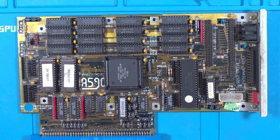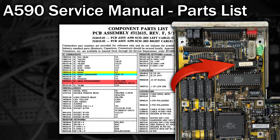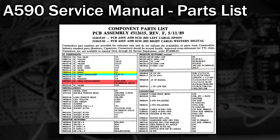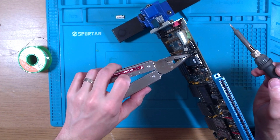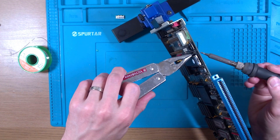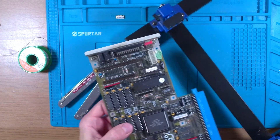Now before powering on there's one further step. If we take a look at the A590 service manual we can see the original DMACC listed here. But interestingly if you take a look at the next line you can see the version 2 of the DMACC is also listed as a substitute. The reason I mention this is because if you substitute the version 2 DMACC then the chip U101 isn't needed anymore. But that's not all. There's one more change that has to be made. You also have to connect up jumper 8, which happens to be right next to the chip we have to remove. Now I don't want this necessarily to be a permanent modification so I'm going to fit a jumper here rather than a link wire. So first I'm going to solder this pin header in so we can attach a jumper.